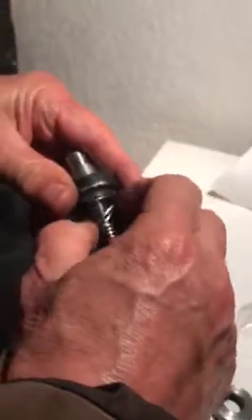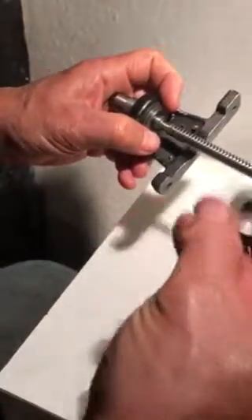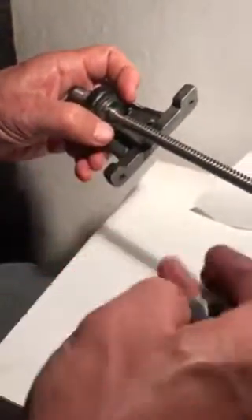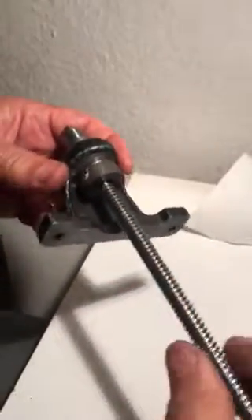138 thousandths thickness, which is 3.5 millimeters. Now I'm going to fit the second set of bearings — it fits neatly on the half-inch part of the feed screw, as you can see. Then now I'm going to take the collar nut — you have about three or four threads left there.